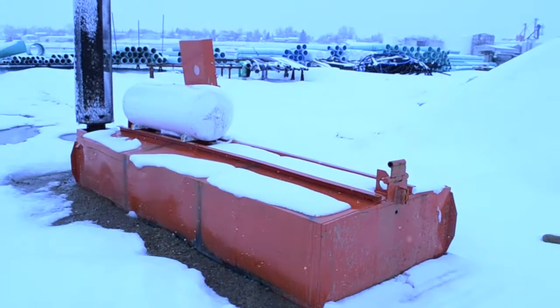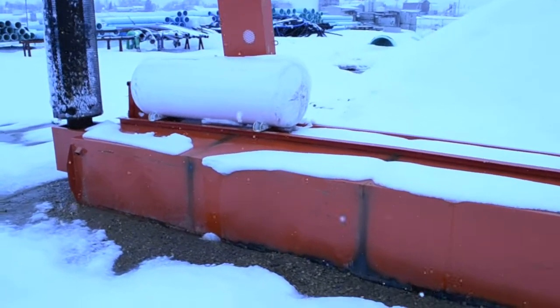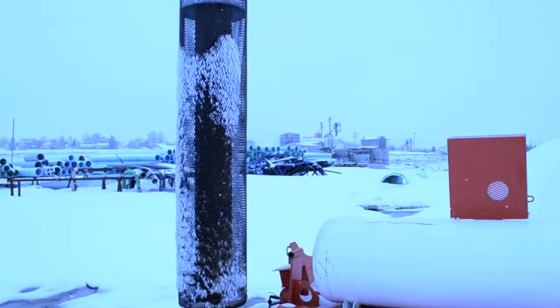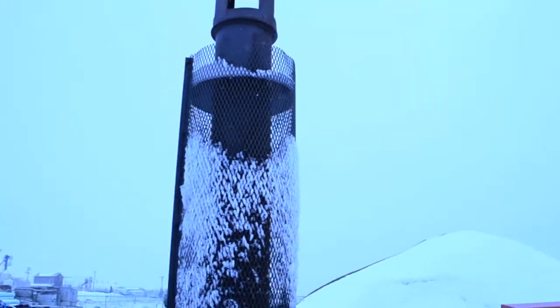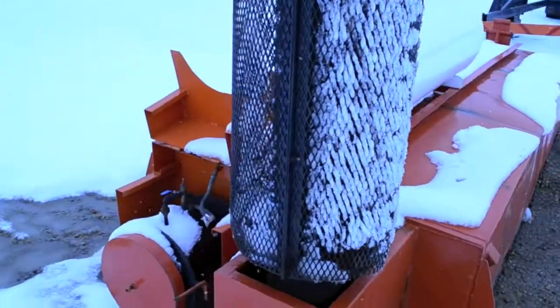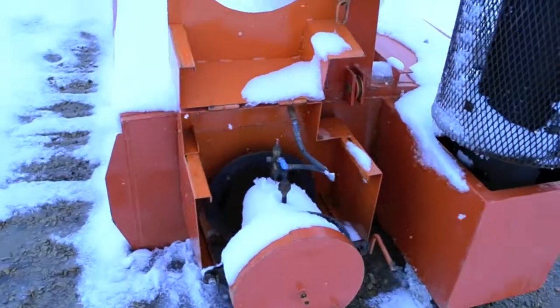It is a safe, convenient, clean and efficient way to allow for hand exposing or hydrovac daylighting of pipeline crossings, utility lines, or even graves in cold climates. It operates on the principle of efficiency, igniting and burning propane gas in a U-shaped tube. Maximum heat is achieved through the use of a patented fire tube energy saver installed in the combustion chamber.